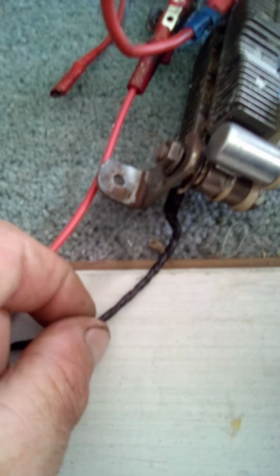So it is possible, as long as you've got a bridge rectifier. See what happens, guys, is it comes out from the three wires there that generally run your brushless motor. It comes into the bridge rectifier here, the three wires, and then it comes around to this side, which is now DC, from AC to DC. And this is the negative side here, and this is the positive side over here. Okay, that's the positive side. That side seems to be more insulated from the metals.